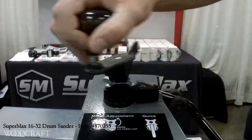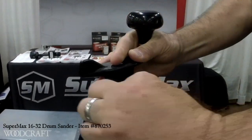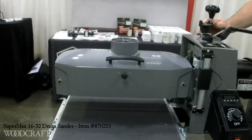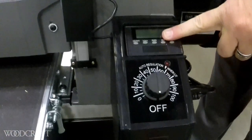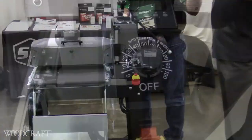No longer do you have to make 64 revolutions to lower and raise the drum head. All you have to do is turn this little knob and now you can do quick adjustments up and down and get your height set. That's your macro adjustments. Here's your micro as well. You can do it with different steps — half-inch, quarter-inch. And even more importantly, we have on this unit a built-in digital readout in the front so you can actually get the same thicknesses over and over again, getting better consistency.